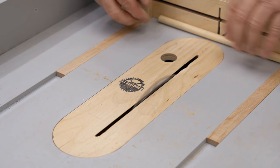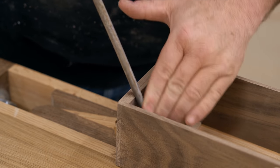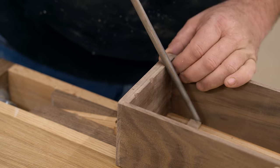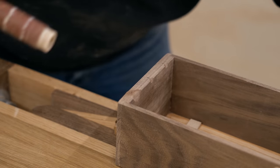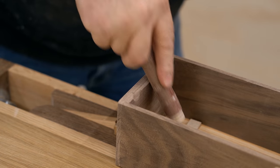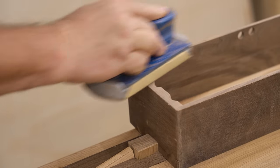For the pivots, I'm using 7/16-inch hardwood dowels. What I'm doing here could have been done easier before I put the box together — these are just shallow cuts that give you a little bit more space to get your finger in when opening the drawer. I could have done it a lot easier on my spindle sander with a 3/4-inch spindle.